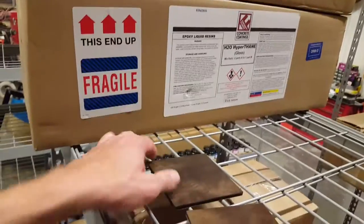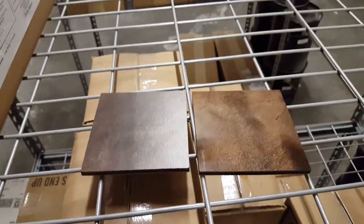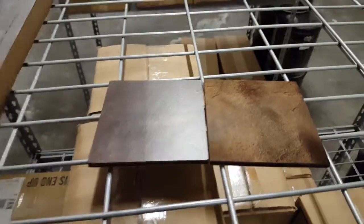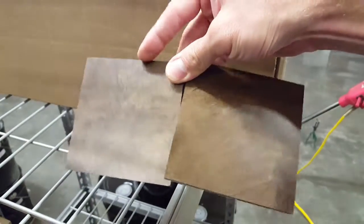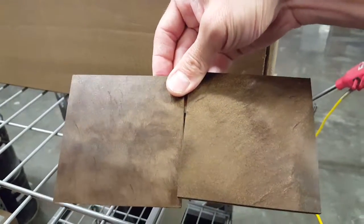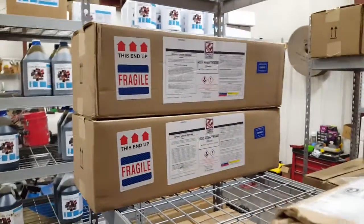We've got a couple of samples here — both are metallic coating samples. We used the water-based gloss on that one, and the matte finish on this one, so you can see an extreme difference. It is the same color; it just doesn't have the gloss with the low gloss finish. I'm really a big fan of the low gloss because it just mats it down beautifully, and we've found that the low gloss urethane has an unbelievable scratch resistance. Again, it's easy to apply and we keep hearing great things about it — that's the Hyperthane gloss and low gloss products.